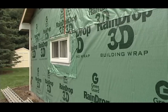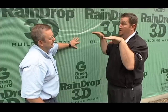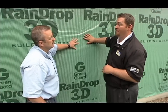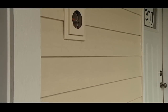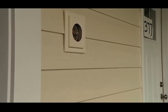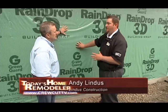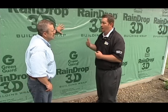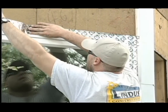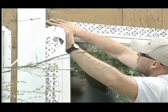You're never going to have to worry about an inferior product behind your siding. You want to look at not only apples to apples on the finished product going on your house, but apples to apples on what's going on before the siding. Not just the house wrap — you want to talk about the proper kick-out flashings, the proper corner posts, the proper electrical boxes, any type of penetration on your actual wall. What's going to be done to make sure you have no water or air infiltration? And the finishing around windows and doors — you want to make sure you're using the proper window tape, or you're leaving yourself susceptible to wind and water getting inside your home.